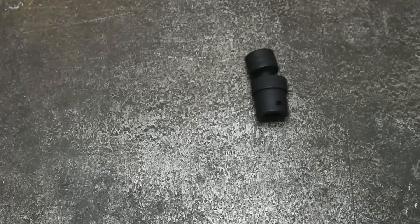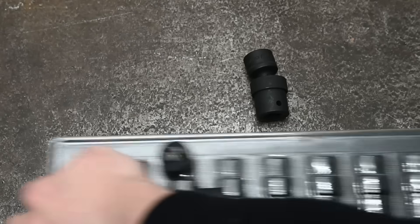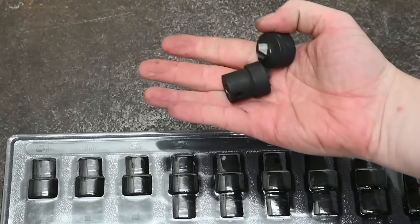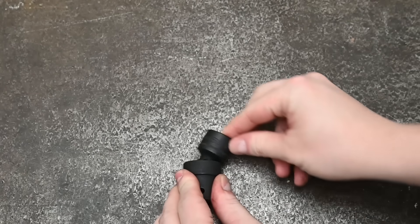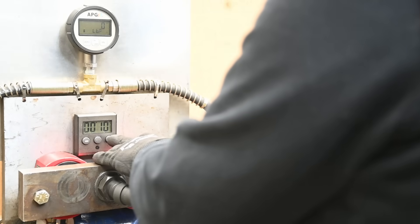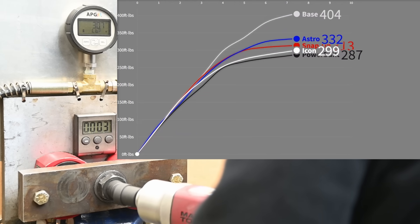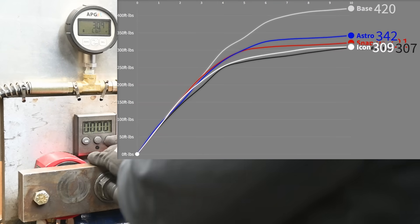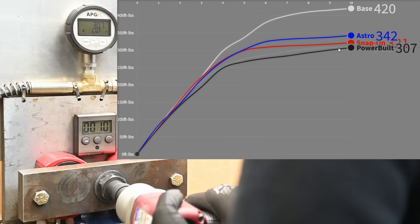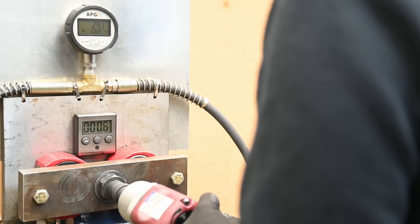On to some simpler designs — Icon half-inch up next. For $140 a set, that's $10.77 a piece. This is the Harbor Freight Icon, 19mm. The 19mm from our 3/8" set met an early demise, so given how many of these have been sold we're giving the half-inch a go as well. As mentioned, 27 degrees of angle — bottom two or three out there — and a rather large pin retention collar. It made 309 foot-pounds; the 3/8" version made 75% of a normal shallow socket, this one made 74% of a half-inch drive shallow socket — in line, but not topping any charts.